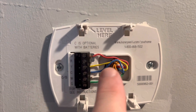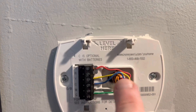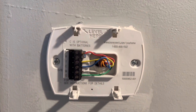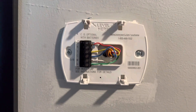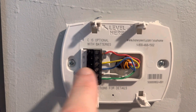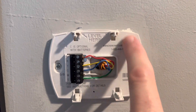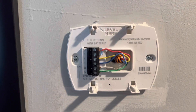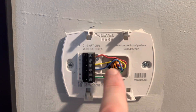These are all respective duplicates running up into your heat pump, so this is very important. For me, I have the C wire, the yellow wire, and all these components already in there — so we're already winning. There's even an orange wire in there. If this doesn't work I'll undo the orange wire and see if that has something to do with anything, because the C wire is where your power is coming from. All the new thermostats are not using batteries anymore.